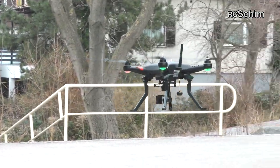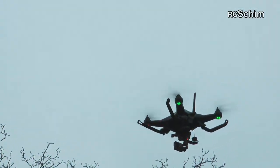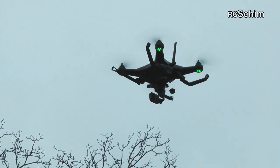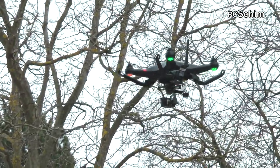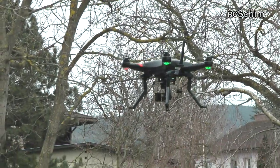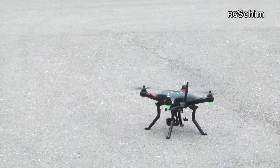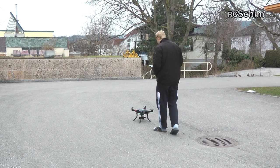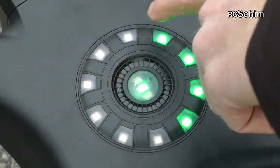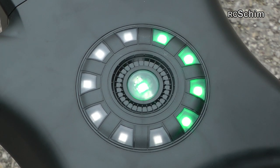After the flight — four and a half minutes of total flying time — I checked my charger to see how many milliamps I could recharge. I topped up 1400 mAh and calculated that using 80 percent of the 6000 mAh battery, you should get around 15 minutes of flight time. The battery indicator on the copter showed below 50 percent, while the app reported 55 percent.